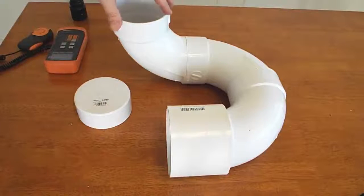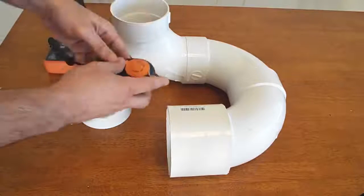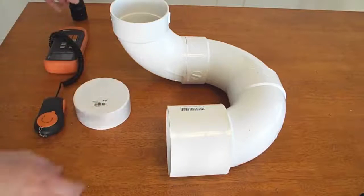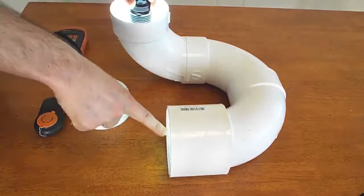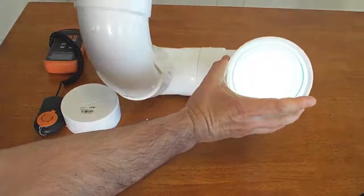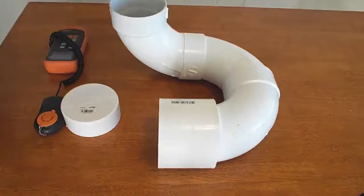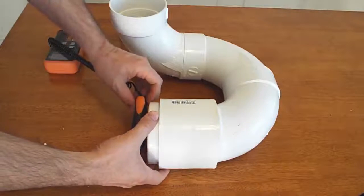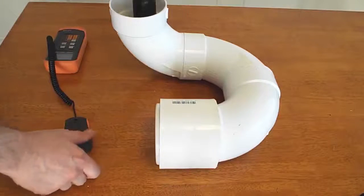Basically the idea is just to integrate the light a little better before it hits our sensor. Here's basically what happens. You fire the light in this end, and you can see it comes out the other end, but it's much softer. It's been integrated and diffused. So what we'll do for this one is, for this cap, we'll make a hole that we can fix our sensor into and then shoot our lights in.